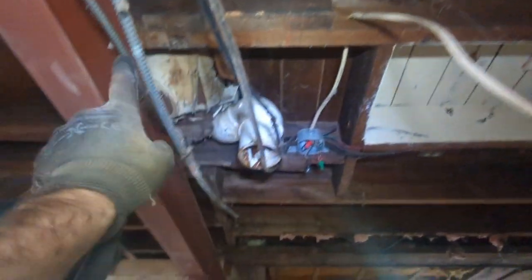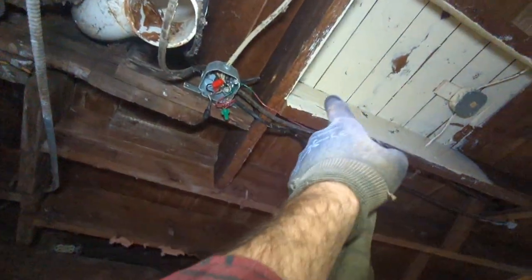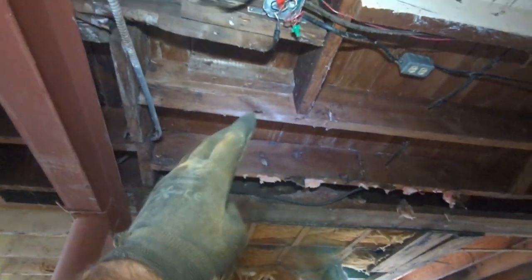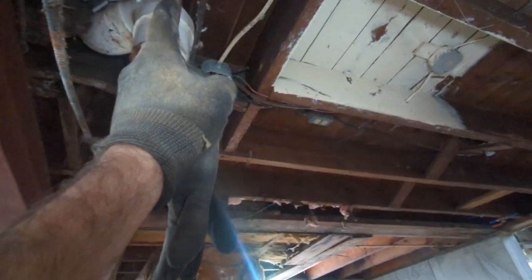Let's see here. This joist here, that's the tail end of that half, and they pass over this beam here. This joist makes it onto the new beam, and all the rest of them do prior to that behind us. And then we got this one who's been cut short here and headed off. So the end of him is being carried by a joist that's on the beam on one side, and it being headed off to a joist that's headed off again before being on the beam, which is an issue in my mind. None of this is going to fall through like a cartoon, but while I'm down here dealing with all these issues here, I got to pull this register end out, and I'm going to get this thing cut up. But notice the hub on the upper elbow is above the plane of the subfloor.